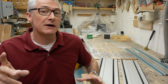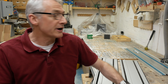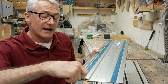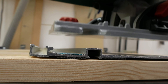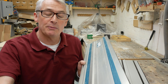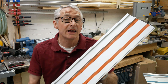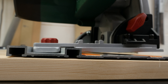One slight surprise is that you do have a problem with Makita rails. Normally, if a saw fits a Festool rail it'll fit a Makita rail. But the Makita rail has an extra anti-tipping lip, where Makita and Titan saws have a little foot that clips under it to stop the saw tipping during bevel cuts. That lip gets in the way of the Parkside saw, so unless you're prepared to remove that lip, you won't be compatible with Makita rails. On the other hand, the saw is fully compatible with Evolution pattern rails — very similar to Festool rails — and it runs on these very smoothly.